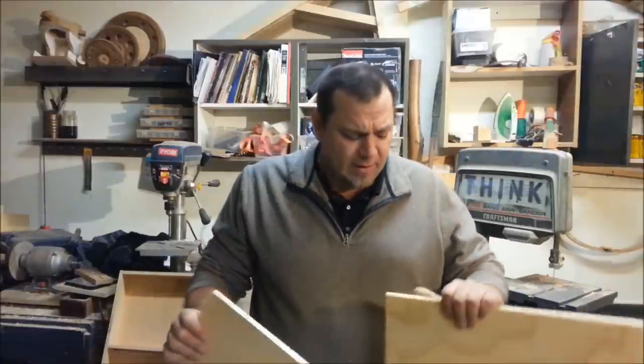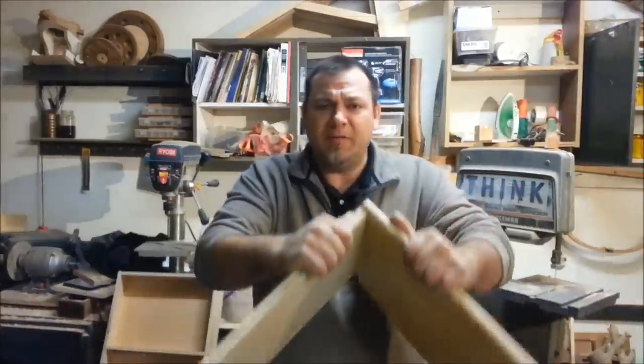I hope you found today's tips useful. You can throw a little finish on those clamps and some paste wax — glue won't stick to them if you use paste wax, or you can put a little tape over wherever the glue joints are going to be. They are handy to have around, ridiculously cheap to build, and fast to build. Tomorrow we're going to use wedges for a different purpose — if you've ever been putting cabinets together and needed to hold two pieces in a corner while you put fasteners in or let glue dry, I'll show you how wedges can do that very thing. Thanks for watching, don't forget to hit like and subscribe — tons of fun stuff coming up.